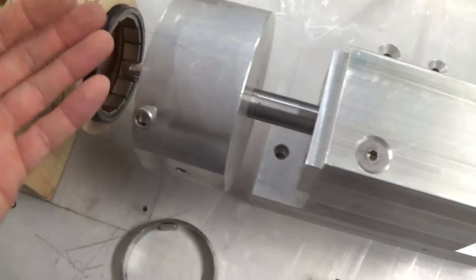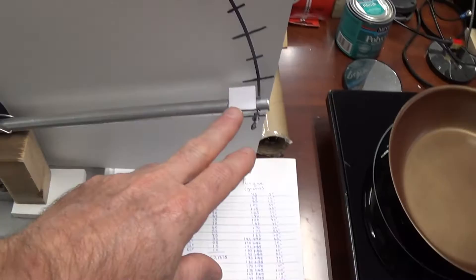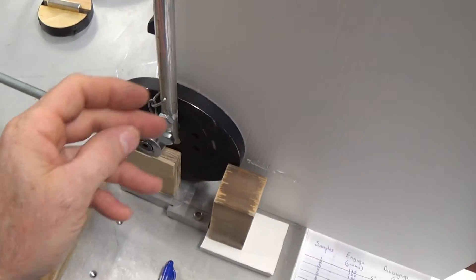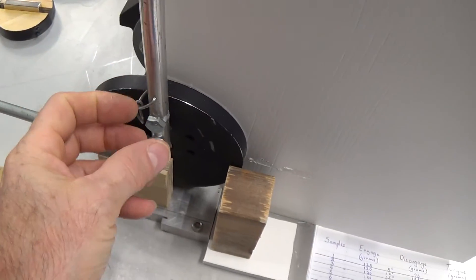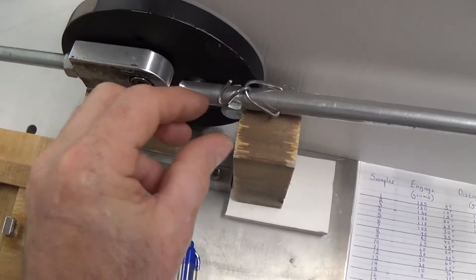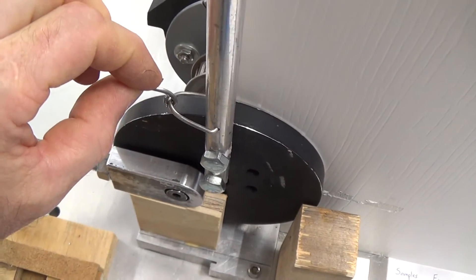I have other ideas I'm not sharing right now — I'm going to build that first. So things are looking better and better. For this particular test, I'm utilizing 180 degrees of activation. I bring the arm up and it's like nothing to bring it in and out. Since this is a foot-pound measurement, I reduced it and made it a three-inch measurement — exactly three inches from my center — and this is where I attach my scale. I get no reading pulling it at the longer dimension, but pulling it at this three-inch dimension I'm getting good numbers and more accurate data.